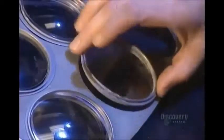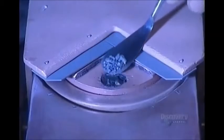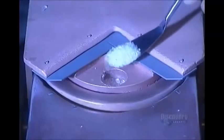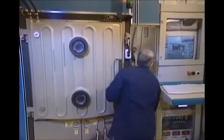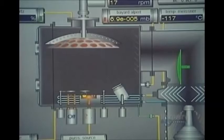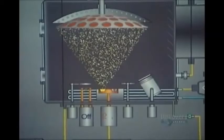Next comes the anti-reflection treatment, which will increase the lens's transparency, allowing in more light. The lenses go into a chamber where they add different powdered chemicals, such as silicium oxide, titanium oxide, and zirconium oxide. They close the door, then pump all the air out of the chamber. Using a high-powered electron beam, they heat the chemicals to the boiling point — the powders transform from solid to gas, coating the lenses in the process.